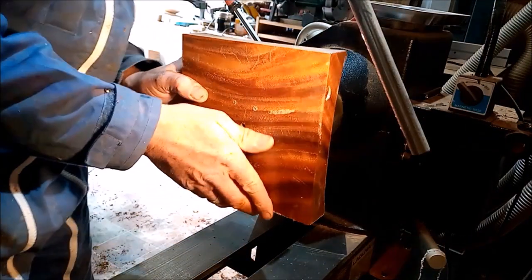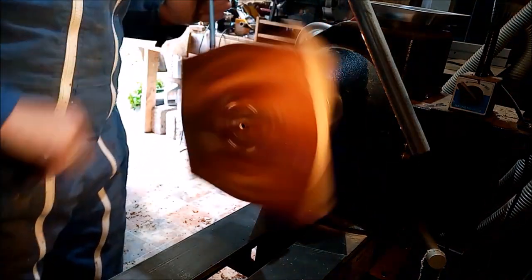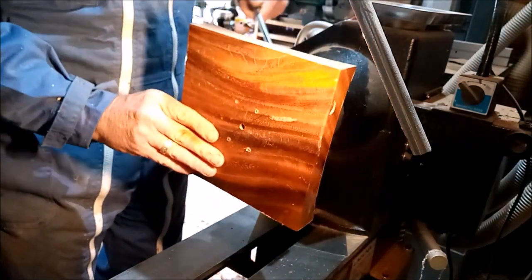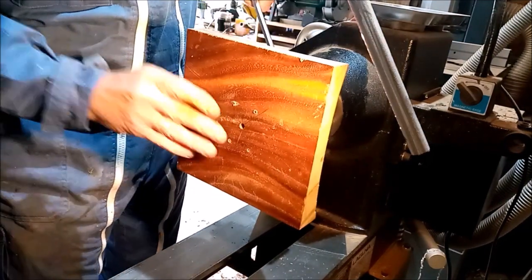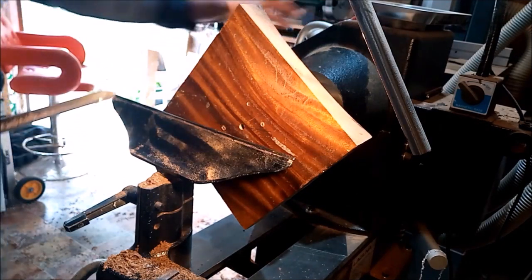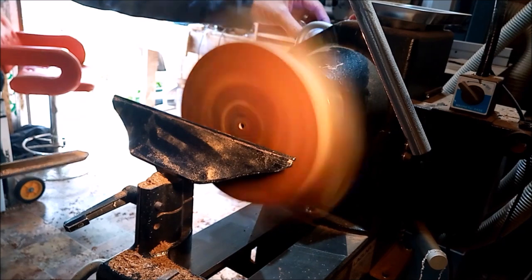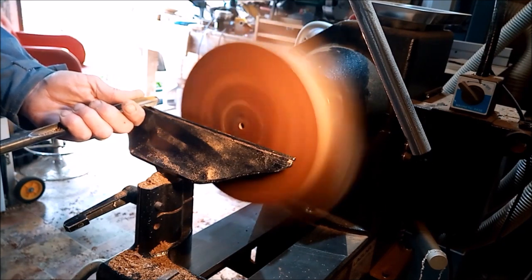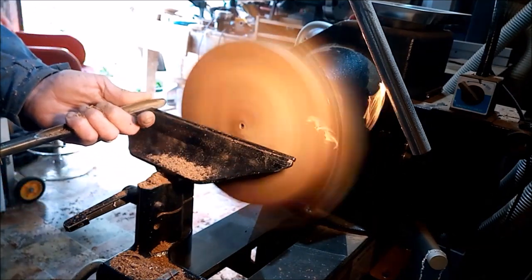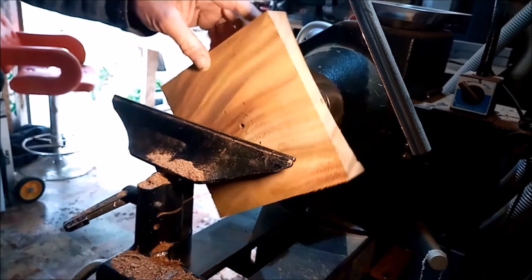And you're mounting in a chuck. If you put your finger right in the middle and push, it kind of helps to balance it better. That's not too bad at all. And tighten it down well. Yeah, that'll do. First thing I'm going to do is face off here. Slowly go in till you find the edge. That was a lot easier than facing up the other side. A lot cleaner too.